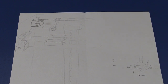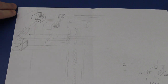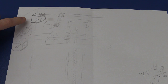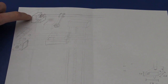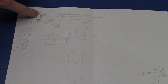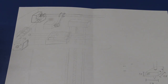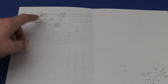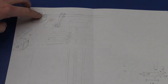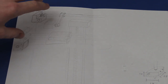I made a few drawings of how I kind of want to make the parts. This line up here is kind of the box that it should be in, and I made this — this is actually the most important piece in the entire printer. It's a corner piece where we have to put a bearing into this hole here, and we will have a shaft that's the entire length — or width — of the printer. It's 50 by 50, so a bearing with a shaft going between two of these blocks, mirrored on the other side — that's why I only drew half of it.